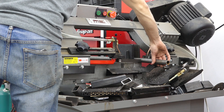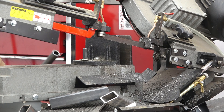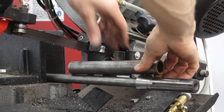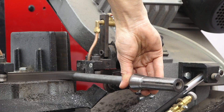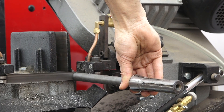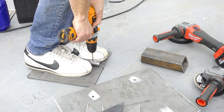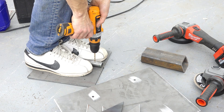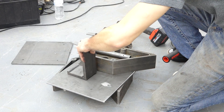The larger diameter tube is cut to be a bit taller than the gussets. The smaller diameter tube is what the collet will grab. I cut this to length using the collet as a reference, so when installed, the collet will bottom out against the shoulder. I'll drill some holes into the outer tube so I can plug weld the inner tube inside of it. And that's really about it for all the prep work, so now let's move on to some assembly.